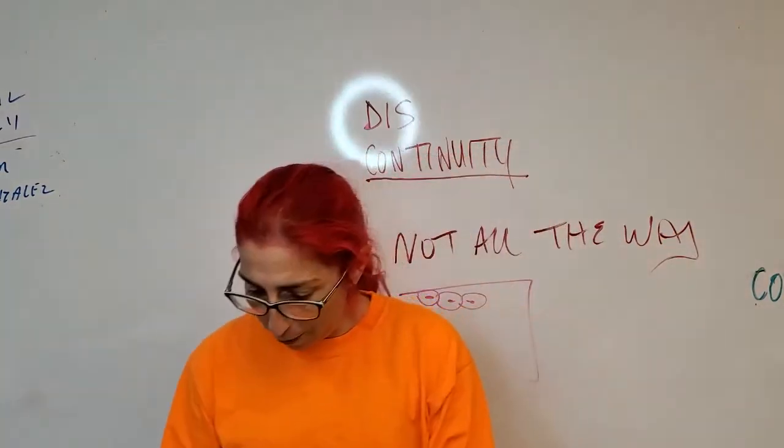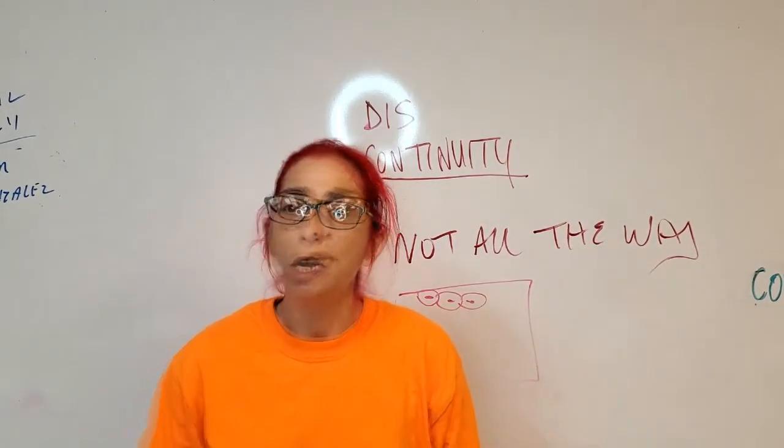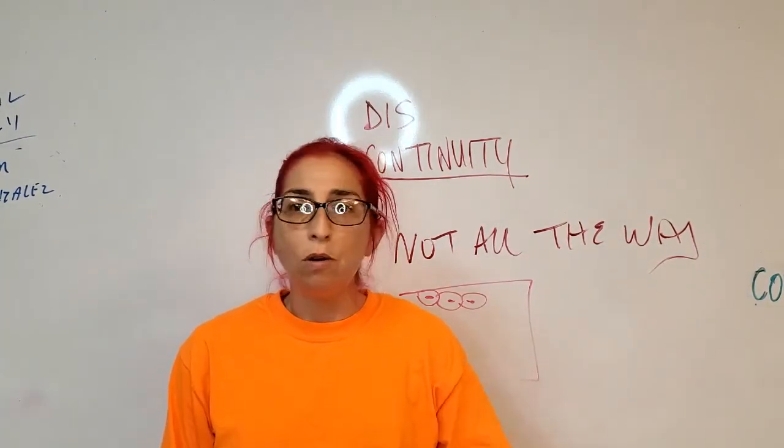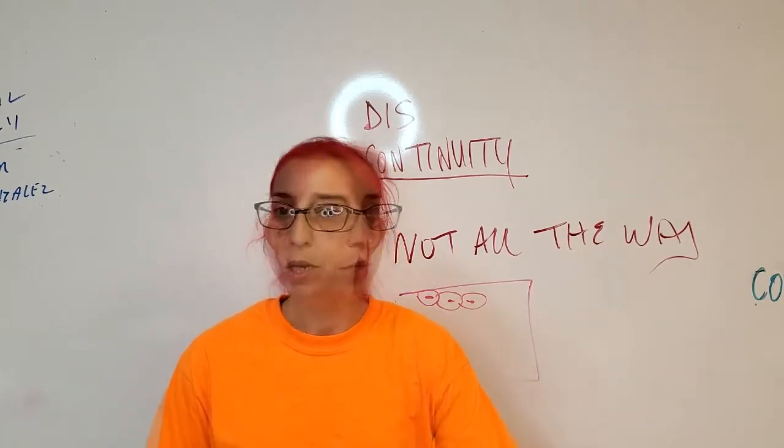All right, solidification cracks. Same kind of thing, guys. We need to make sure that we, A, pay attention to your heat, but when we quench, we can cause cracking when it's starting to solidify. We quench it too quickly.